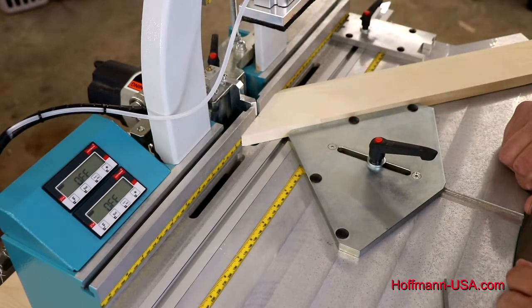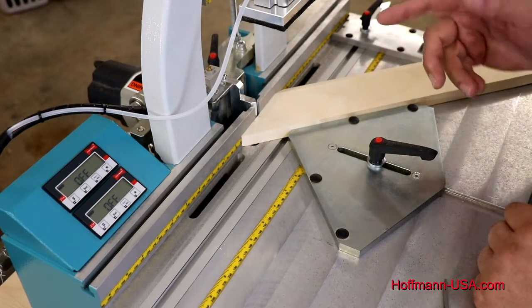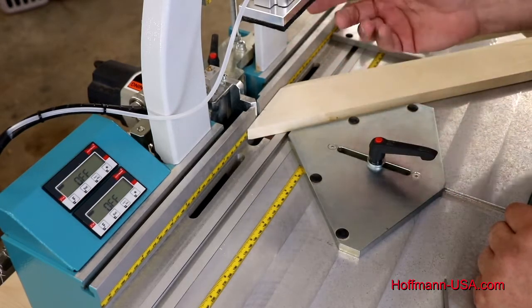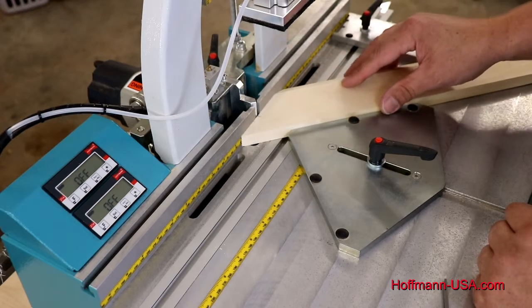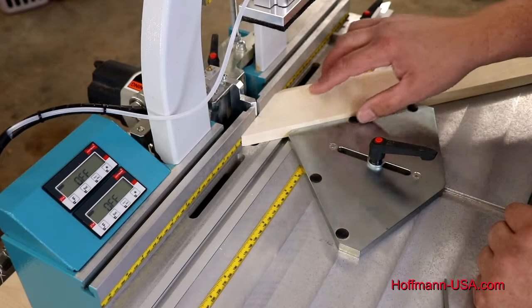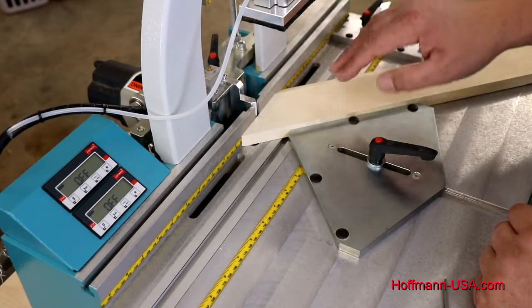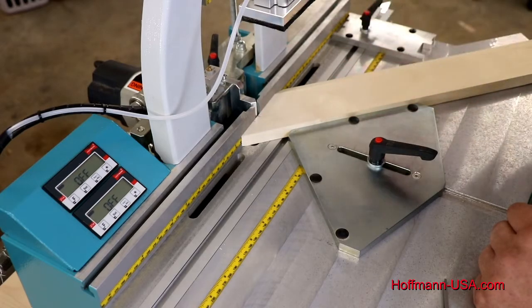This is also how you use your display for keyway locations. Let's say this is your molding pieces one, two, three, four. At 40 millimeters from the tip, that's a good setting for your first keyway. Make yourself a chart — write down: pieces one through four, first keyway at 40 millimeters.